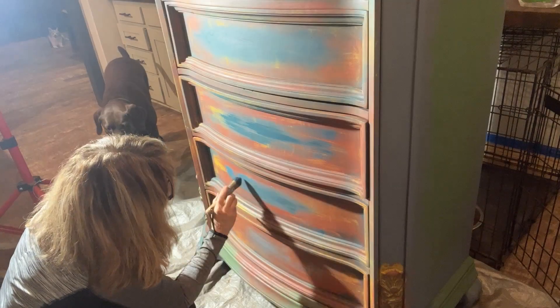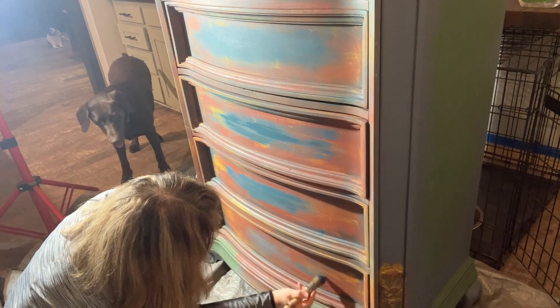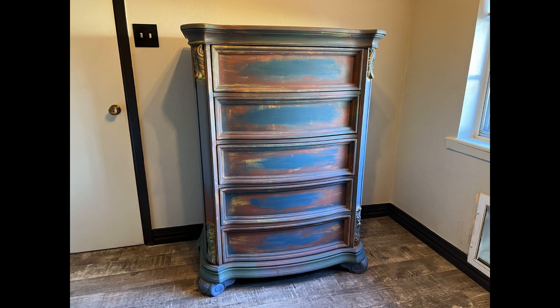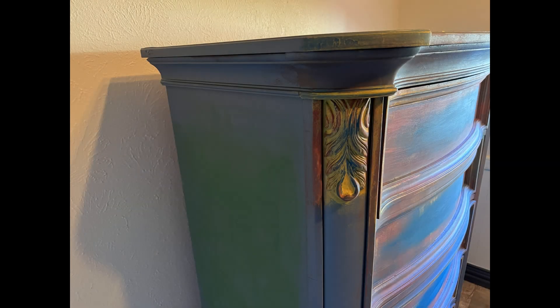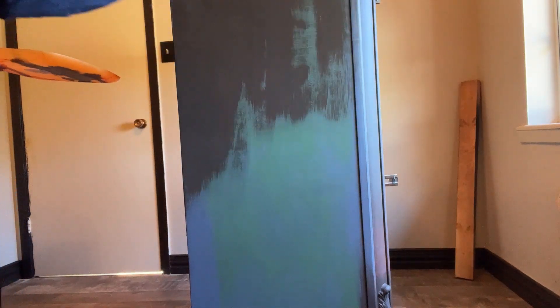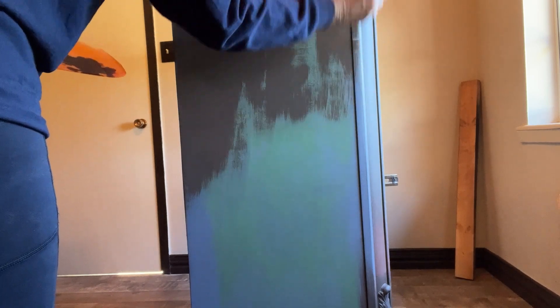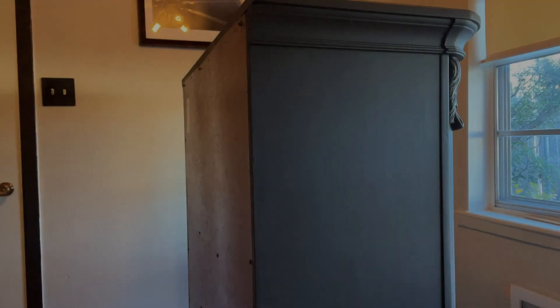Finally, I built up enough courage to use the antebellum blue to finish off the drawers with a bold look. While I was very happy with the paint application on the doors, I just couldn't get over the whole paint look of the sides and the top. At this point there just seemed to be too much color going on, so I decided to paint the top and the sides in chocolate brown. I know it seems like I'm going in the wrong direction with this brown paint, but it actually serves two purposes: one, to seal the gray primer, and the other is to provide a framework for the colored and painted pieces, which you'll see at the end.